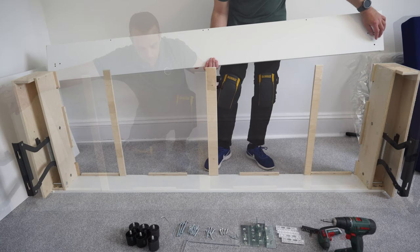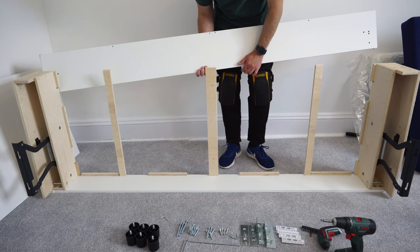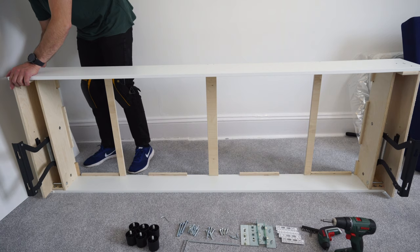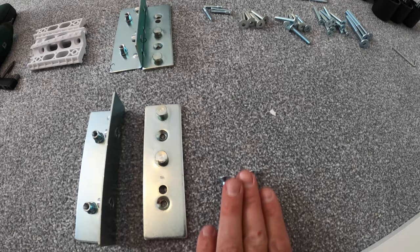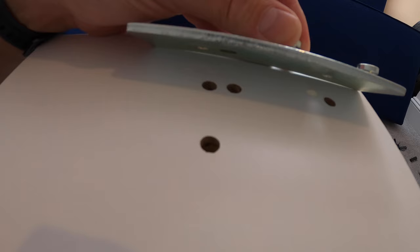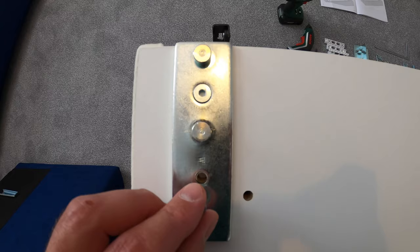Now we have the bigger panel. You see the four holes on one side and on the other side there are those panels for the support of the bottom of the storage space. That's going exactly the same, lining up with the side panels and the other smaller panel. So at the moment it's at the bottom part. Line up the holes on the edges — you're going to have four holes in this case. You're going to need triangle head bigger screws with the two brackets — the L-shaped bracket and this bracket. The bracket comes in with the two hooks on top.